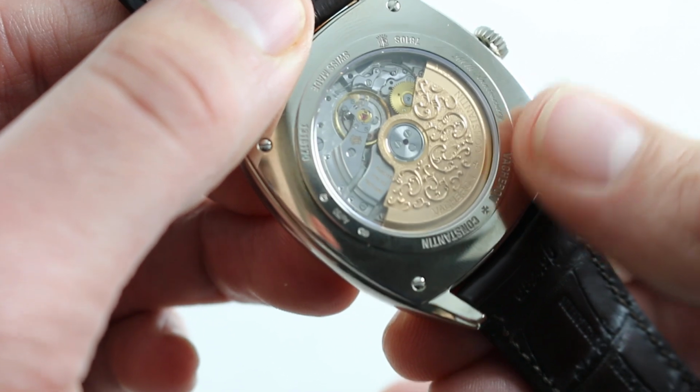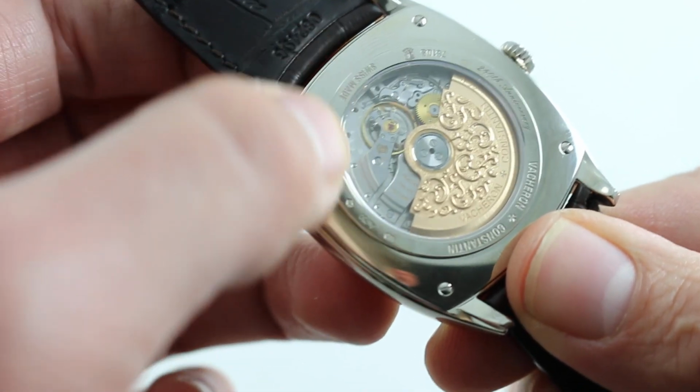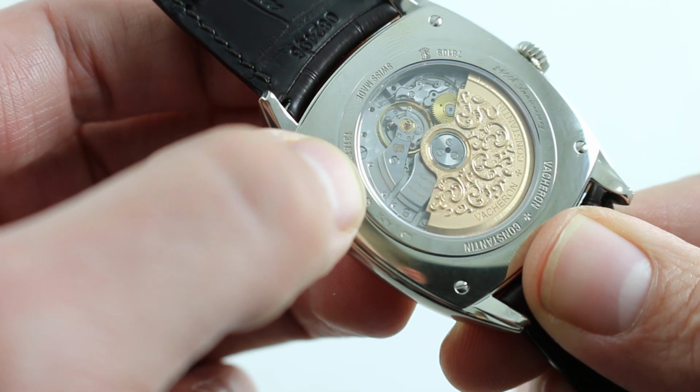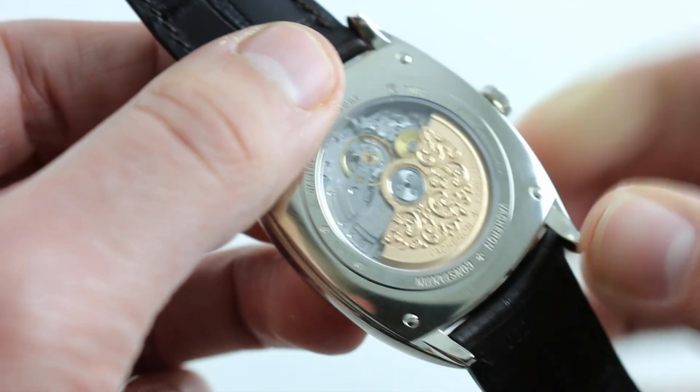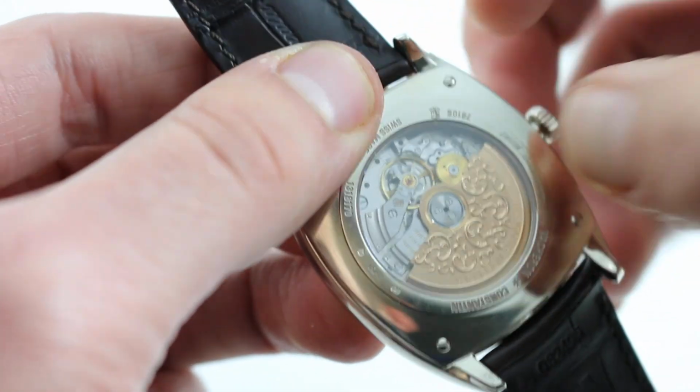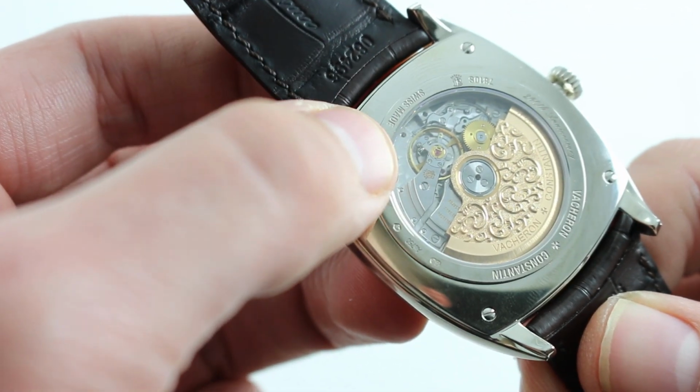This movement was designed by Vacheron Constantin to serve its complications as a base caliber, and it helped to phase out the long-running JLC 889 and its derivatives in the Vacheron Constantin catalog. Now, you can see that when I pull the crown to extremity, it does hack the balance, so you can precisely synchronize this watch to a known accurate reference time.